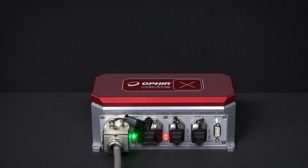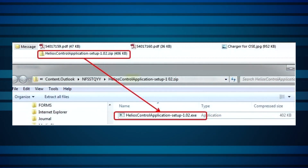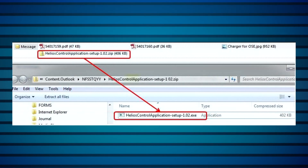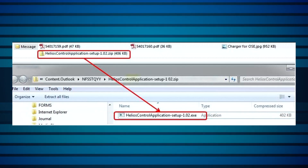After test measurements are done satisfactorily, the next step will be to integrate the power measurement into your facility's software, controlled by the PLC, as fits your application and needs. For RS-232 setup, this will use the same PROFINET power cable, but communication will be via a standard RS-232 D9-D9 cable. Install the Helios control application by copying it from the included CD and following the installation wizard steps. After test measurements, you can integrate the power measurement into your software by scripting commands, again according to your application and needs.